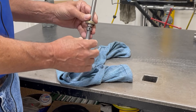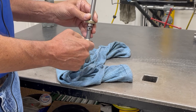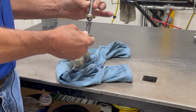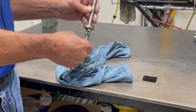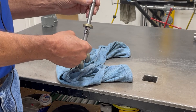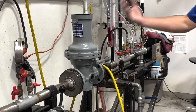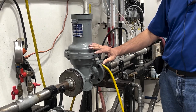So we're going to be reversing the order in which we set the valve, so that our adjustment is going to be on the top valve versus the bottom part. The valve will initially seat the bottom part of the valve assembly on the orifice, and we'll do our adjustment with the top portion. I wanted to draw that distinction between the two so that if you've viewed the 441 valve assembly setup, you would see that there is a difference between the two regulators.